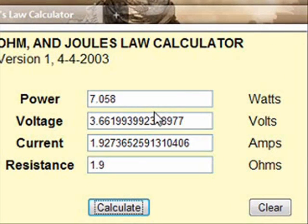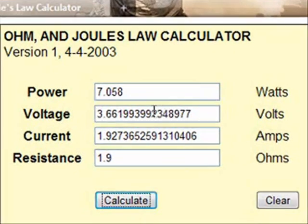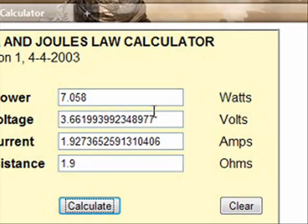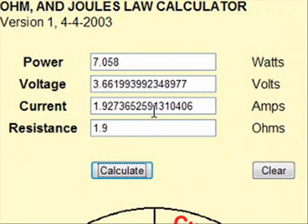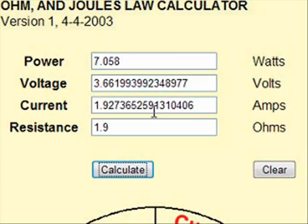So no matter what the resistance of my atomizer is or my voltage, the main thing is wattage. Once you set that wattage in and then your resistance, it will tell you exactly what to set your voltage at to keep vaping at that wattage. If you like that vape, this will make you stay there. You'll get a more consistent vape because you're holding that wattage constant — it never changes. Your vaping experience should be a lot better and smoother, and you shouldn't be burning atomizers anymore or having too low heat or not getting the flavor that you like.